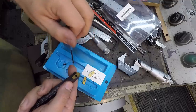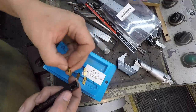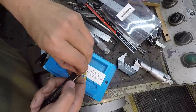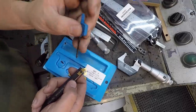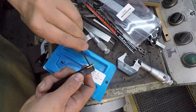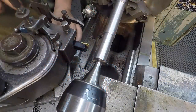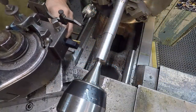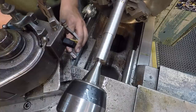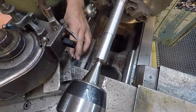The kit comes with the wrench, comes with an extra screw. And the inserts are interchangeable for the boring bars as well. All right, there we go. This is a tool holder that I already had set up for this shank tool, and my height gauge that I keep set for center. So we're good to go, just checking the center height of the edge of the tool there.